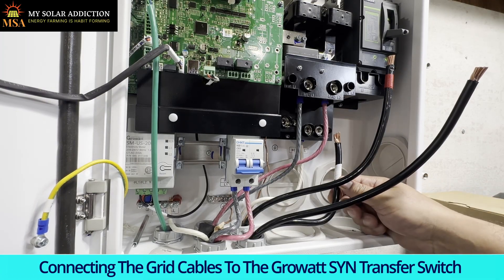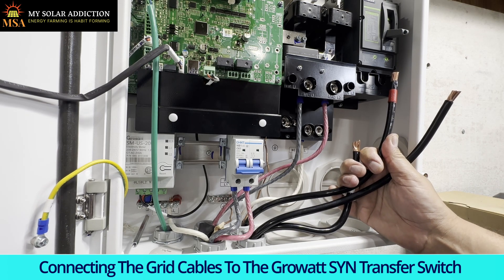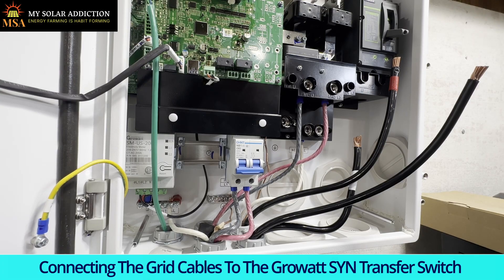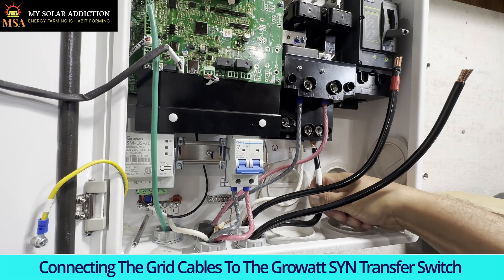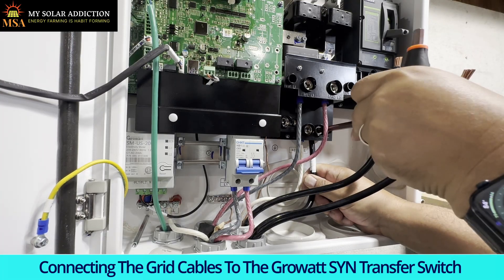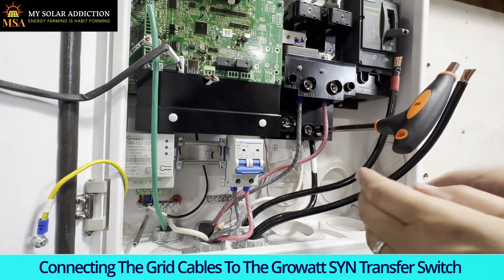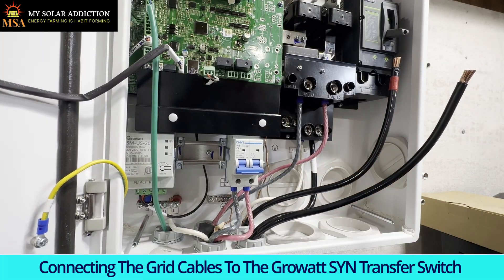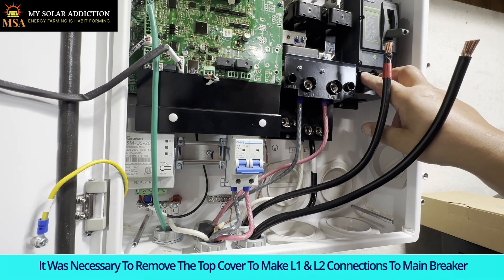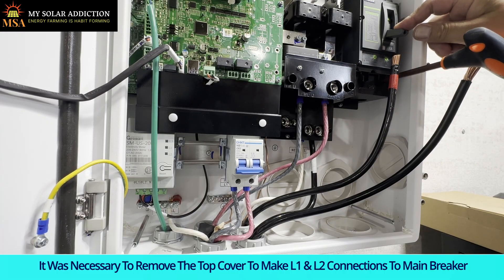Now we're ready to do our grid connections. These wires are not hot - I haven't connected them to my grid connection coming from across the room. Let's go ahead and do our neutral first because it's behind the other wires. I've already stripped them - we'll put the neutral in and tighten that up. We need to go back and tighten these to torque specs, but I'm going to get them decently tight first. Once everyone is in place, we'll torque those up. To get to the ports for L1 and L2 for the 200-amp no-arc breaker, I had to remove the plastic cover.